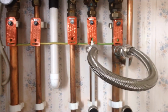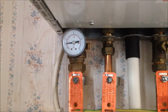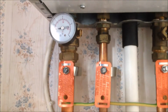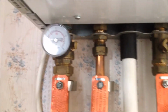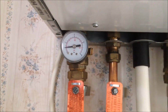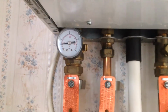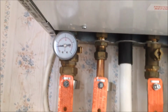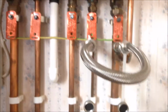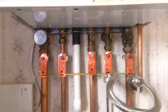It used to be like 4 to 6 weeks we need to top up because the pressure drops to like 0.2 bar or nearly 0. So when it's too low, the boiler won't work properly or stops working, and we need to top up the central heating water pressure. And now it's getting worse and worse. Something like 2 or 3 weeks we need to top up the pressure of the central heating. I have got another video on how to top up this boiler water.